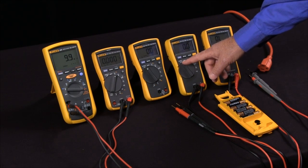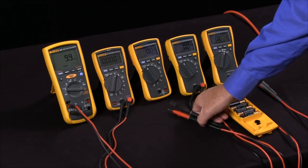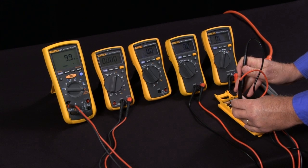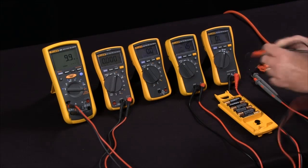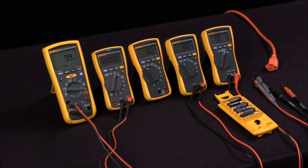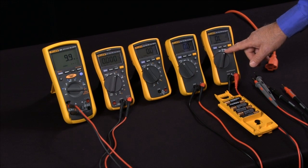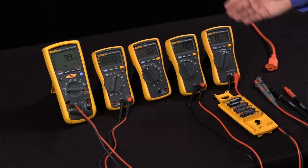In addition, meters that are not fully automated with V-Check include an Auto V mode. Auto V with Low Z means if I'm looking at voltages and hit DC volts, it automatically switches into DC voltage mode, sets it to the proper range, and takes the reading. I can then quickly switch over to an AC reading and read AC volts. So Auto V automatically selects the voltage function and range, and V-Check combines Auto V and Low Z into simply turning your meter on, taking your measurement, and it does the rest of the work for you.